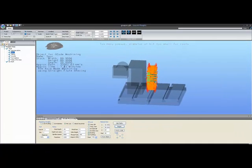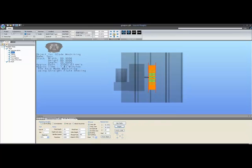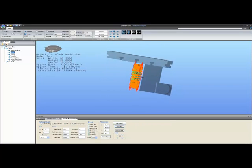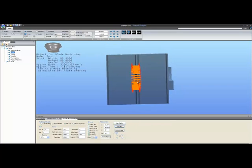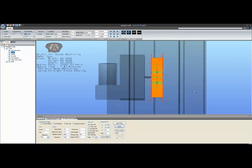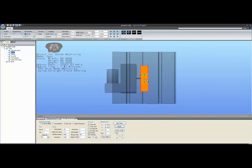And you remember what I said earlier, when you press the center button to look down on your object, you might have to press it twice because it goes upside down if you press it while it's pointing directly out. So make sure that you're looking at it the right way. This is the right way. X is across the horizontal, with X+ being to the right and X- to the left. So in my system, the 4th axis is pointing along the X-axis.